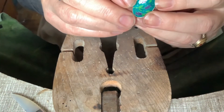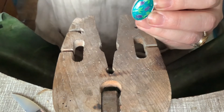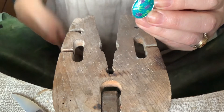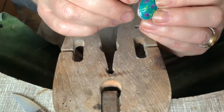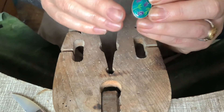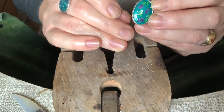That's pretty much done now. What I'll do next is take it over to the polishing motor where I've got a soft buff with white Luxie on it. I find that just gently rounds off any very slight edge that you can feel, but it'll just make all that disappear. The Luxie is soft enough that it can go over the enamel and it just finishes the bezels beautifully.